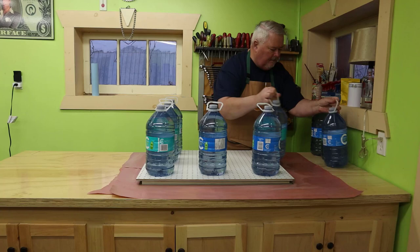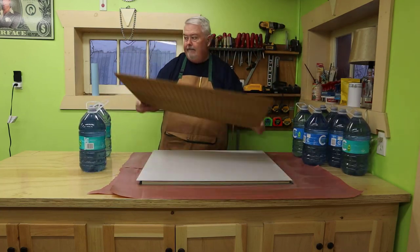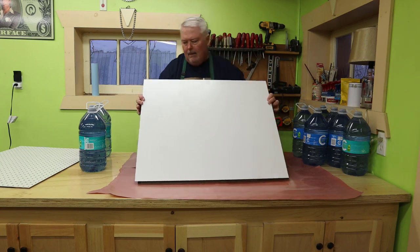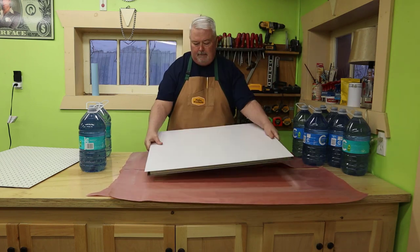It's dry just like that, so let's keep moving. Off go the bottles and the pegboard. The surface looks flat. I like to check the edges to see if there's any gap between the plywood and the laminate — and in this case we look great all the way around. So this lamination gets the big thumbs up.